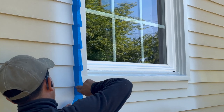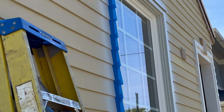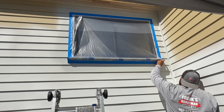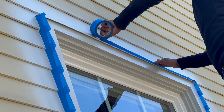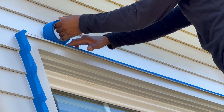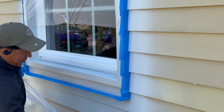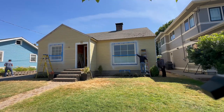Take your time — in this case we have a lot of little strips following the layers of the siding, and those strips give you a nice clean, perfect line all around the window trim. Then we put tape on the top, tape on the bottom, cut the masking film to size, put that in between, and press down the tape around all of the edges. That seals up the entire window so no paint gets on the glass or trim.